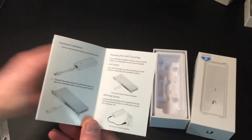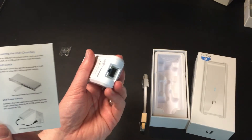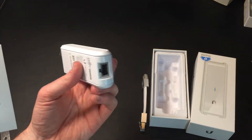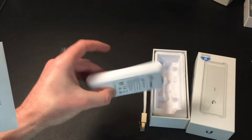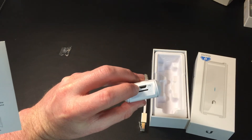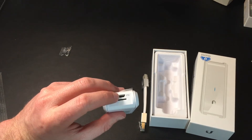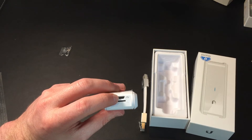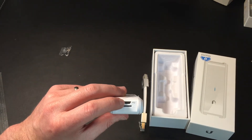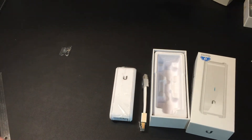Down here it says 'power source' and there's a cable and it says it's not included. The reason is this is powered by power over Ethernet. So if you have a power over Ethernet switch, that's all you need. If you're connecting it to a switch that is not power over Ethernet, you will need to provide it with power, and that's what the mini USB is for. There is no USB cable included in the box, and there is no adapter or anything like that. So just FYI, if you're getting into a switch that doesn't have power over Ethernet, you will need a couple of additional bits and pieces.